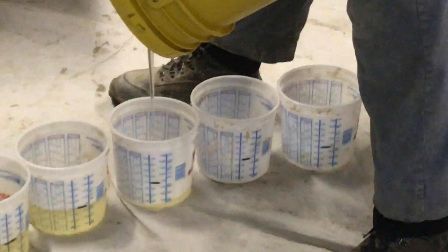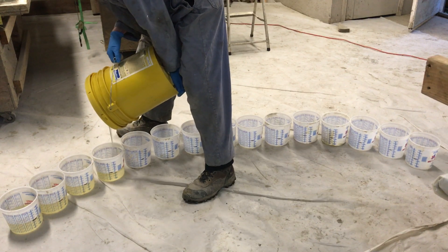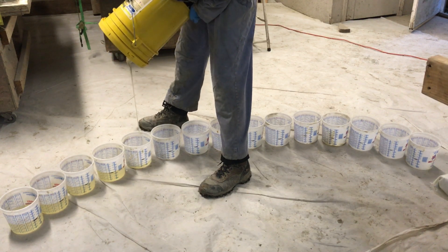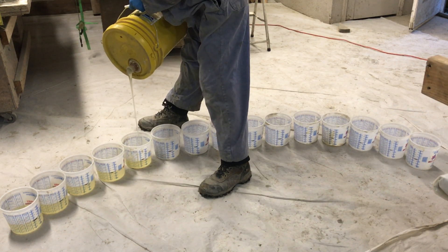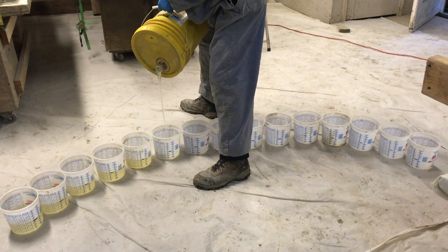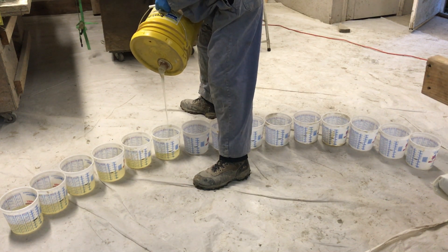In this case we've opened up a five-gallon container of each Part A and B. You're not going to use a couple of tubs out of this, close it back up, stick it on the shelf, and expect the yellow part to still be usable. It draws moisture, gets hard, and coagulates — it's not something you buy, use a little bit of, and come back to later. Even in a couple of days, especially in rainy Oregon, it'll start to set up and become useless. We open a can, we use it that day.